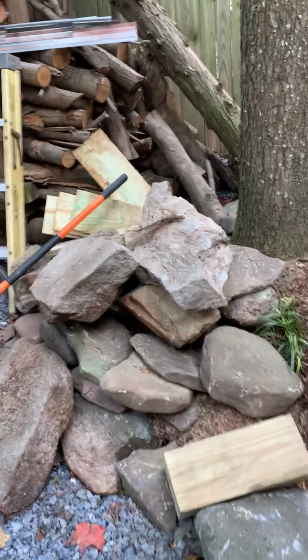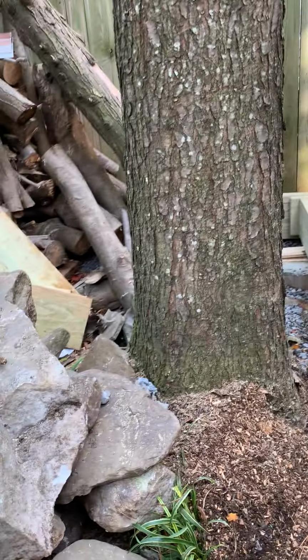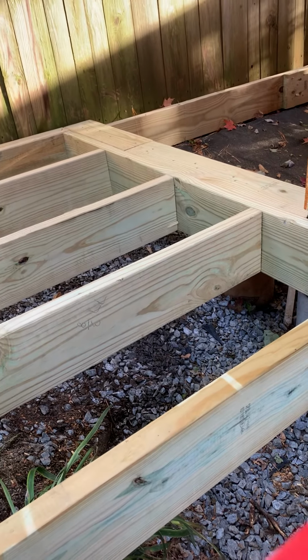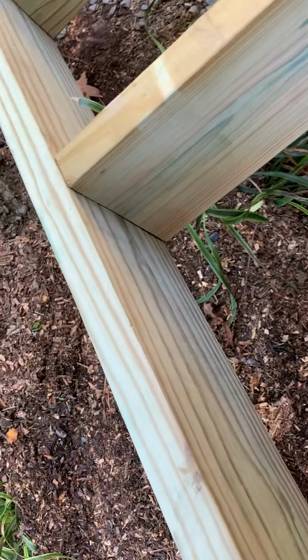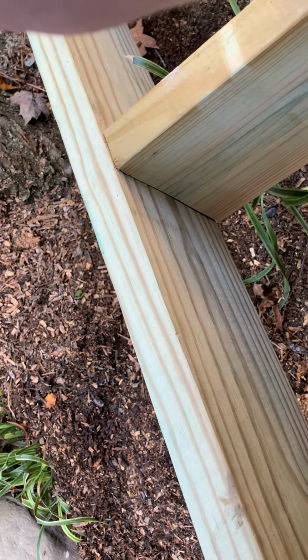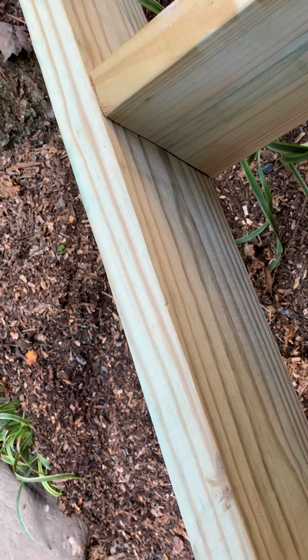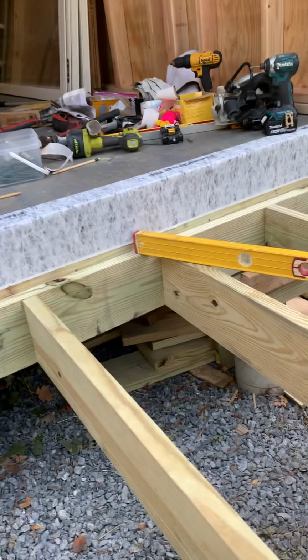I'm going to go down and double check mine. I'm ready here. Okay, go ahead. Check left. Hold on. I want to make sure we're still at 6 5/8 because, you know, measure three times, cut once. We've had people reading tape measures upside down. I'm at 6 1/2 now, so that makes sense. Well, yeah, because you pivoted it. When you pivot one end, the other end goes down or up. Okay, you're 6 1/2. I'm at 6 1/2 sharp, sir.